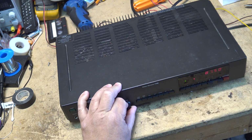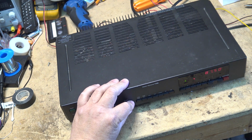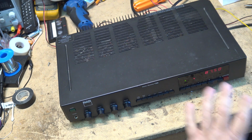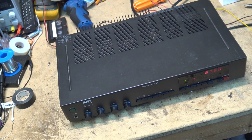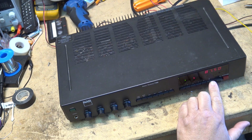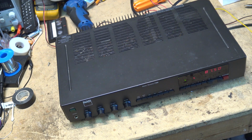I love the LED display on it. So many receivers went to vacuum fluorescent display, which, the VFD, also looks nice. VFDs look nice for digital displays, but I really like the red LED. I think that makes this piece just stand out. And it's a 4-digit display because it goes in 0.05. Not that that's necessary because our channel spacing here is 200 kilohertz, right? But this here goes in 50 kilohertz spacing. But that just gives it more of a linear feel when you're going through the frequencies.